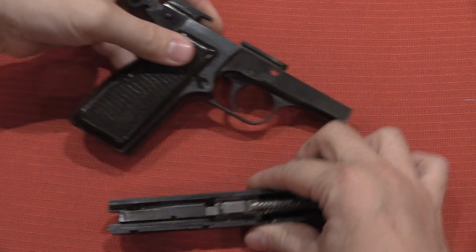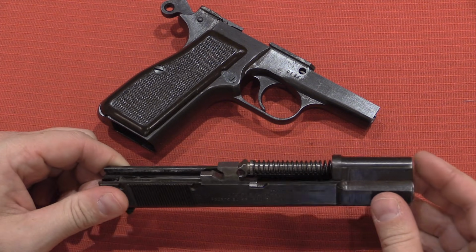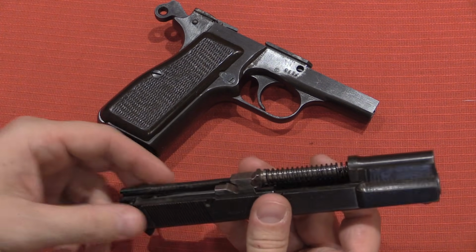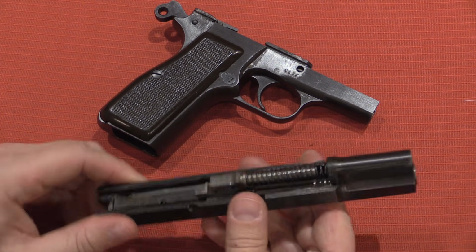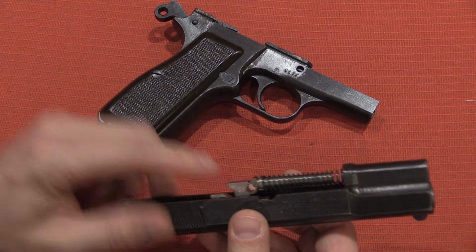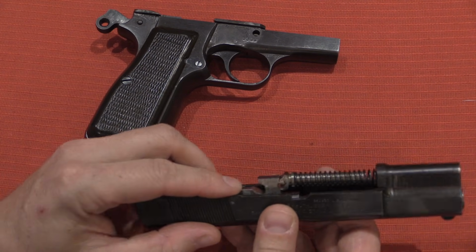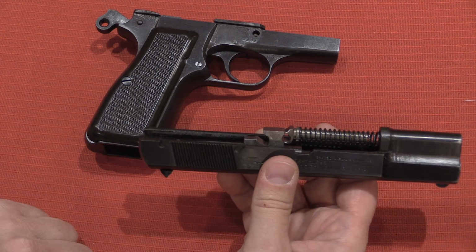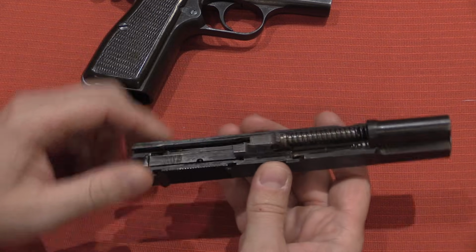This pistol was finished by his Belgian protege, Dieudonné Saive, and it was ultimately adopted by a number of countries in the 1930s. So the improvements he made were to replace the swinging toggle link in the Browning barrel with a slot acting on a cammed surface. Makes it substantially easier to assemble or to manufacture.